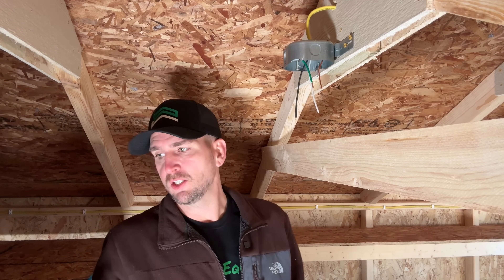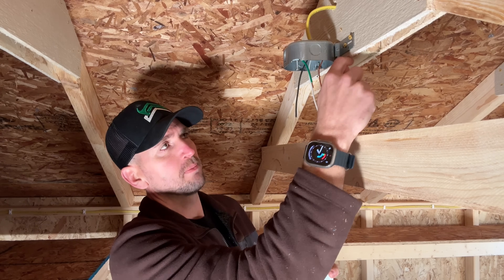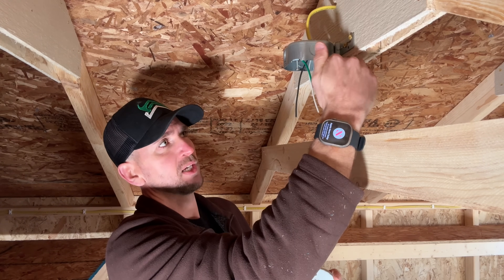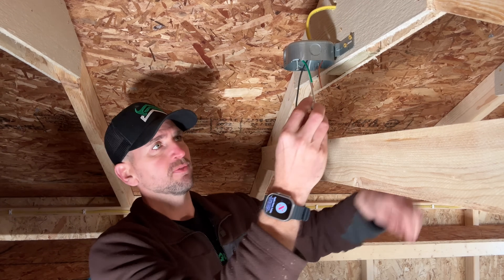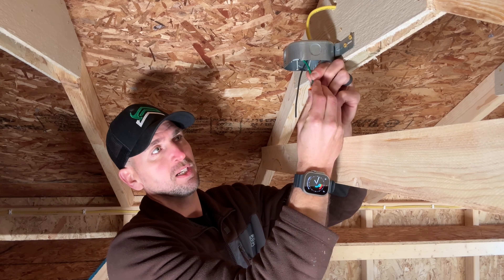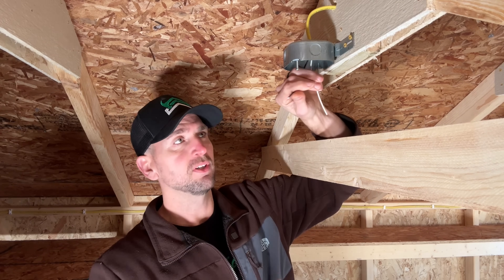Now we're ready to start the wiring. I'm going to start at this first light location using a simple porcelain lamp holder. Just remember when you're mounting your box, you usually need some clearance so the lip of the porcelain lamp holder doesn't have anything it's going against — so make sure that bottom lip is hanging over so the lamp holder won't have any restriction. And you'll see me using tools like WAGO lever nuts, which make these jobs so much easier — bringing together two grounds is as simple as pushing it in and flipping a few levers.